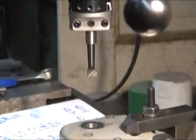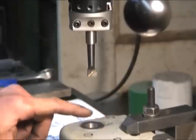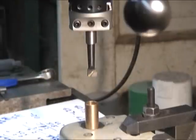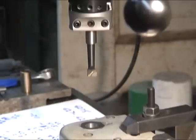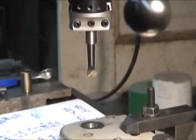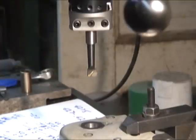Right now the hole is bored out to 0.616 and the bushing measures out at 0.6275. I'm going to take 10 thousandths on this cut, so it should give me 0.626, and then it's really hard to go by the dial and get something accurate.